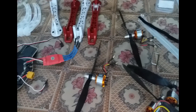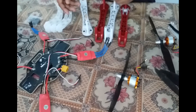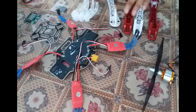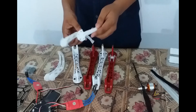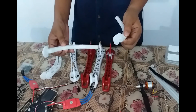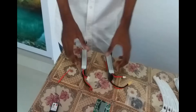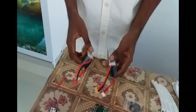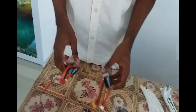The speed of the motor is controlled by ESCs — electronic speed controllers. These are connected to the distribution board where power from the battery is directly connected to the ESCs and then to the motors. I also suggest for beginners to use landing gears, as they reduce the impact to the drone while landing. In this drone we are using a lithium polymer battery which provides high output current, because we are connecting 4 drone motors in parallel.